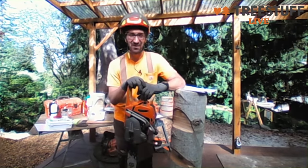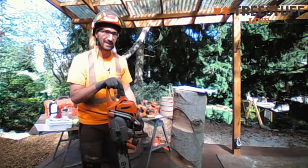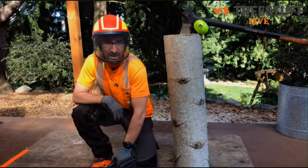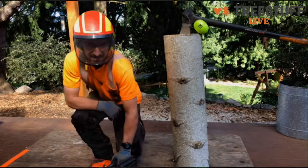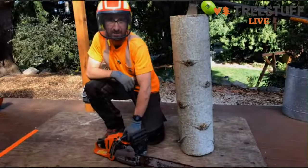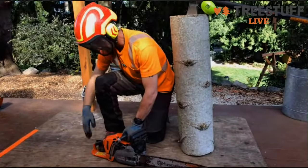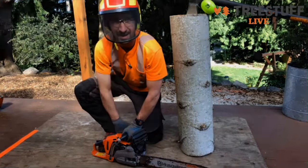Secondly, a question came in that Kale mentioned to me during the video around starting saws. And let's go over to the other camera for a second, Kale. All right. So over here, if I'm going to start this saw, are you able to see my feet, Kale? Let's tip the camera down a little bit. When I'm going to start this saw, the safest and most secure way to do it is left hand on the wrap handle, making sure my chain brake is on, right foot through the rear handle. This gives me a lot of control over the saw. And then I can start it with my right hand.